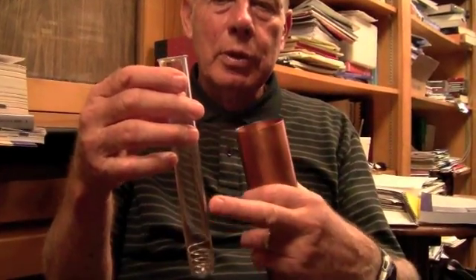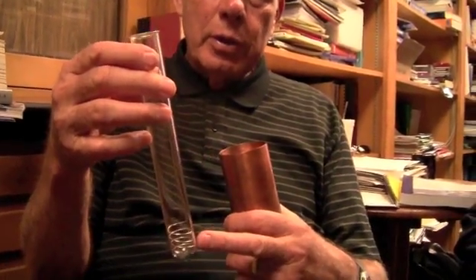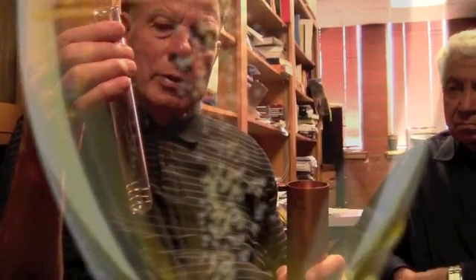The reason you want it narrow is because the gas will keep the mixing going on well, so you have good mixing and good stirring. That was one early criticism — that there wasn't good stirring. But there's very good stirring if you make it narrow. If you made a big wide cell, there wouldn't be good stirring. But the gases coming straight up stir everything very well in a cell this size.